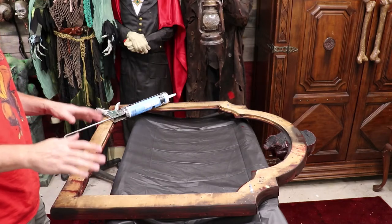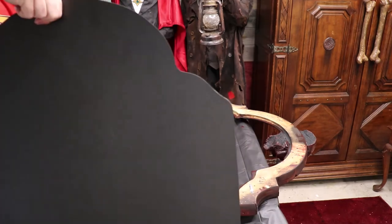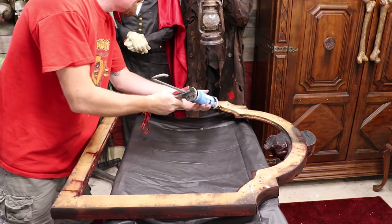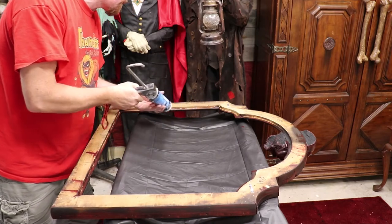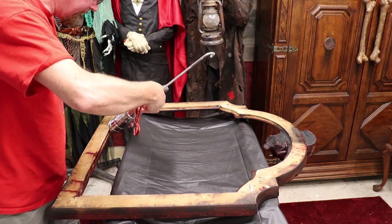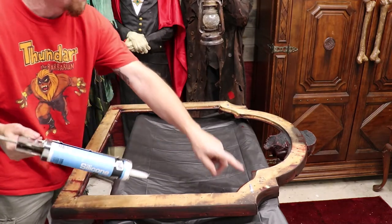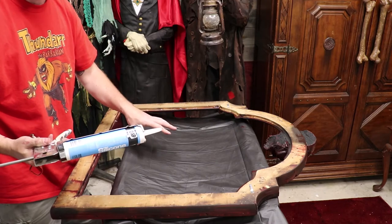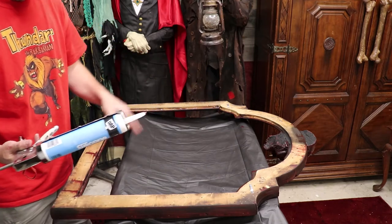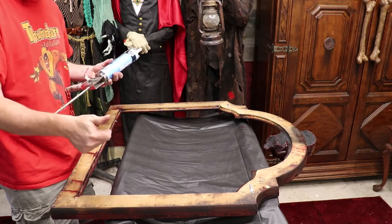Okay YouTubes, our frame is done — it's stained, I got the eyeballs glued in, I got all the wood and spikes glued in. The last thing we've got to do is put our magnet board in. We've sandblasted this and put some chassis paint on it, one coat — we're ready to drop in. I'm going to go ahead and silicone this in, put a couple of dabs here and there and run a little bit around. Then I'm going to throw some screws in this on the back side to help hold this monster in. It's going to be heavy because it's 20-gauge sheet metal. I've got two hangers on the back — instead of using a single one, because kids are going to be pulling magnets off this board, I don't want this thing ever coming off the wall and hurting anybody. So I've got two hangers installed.